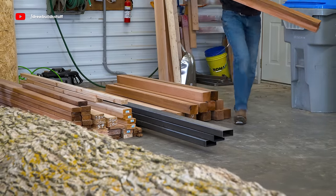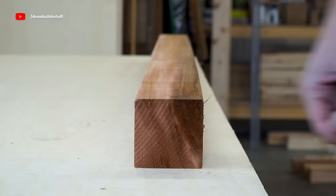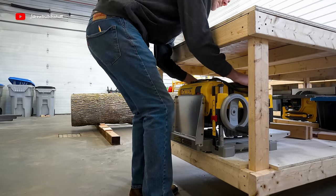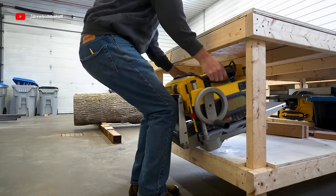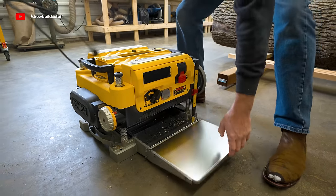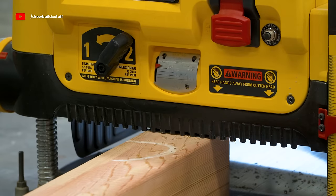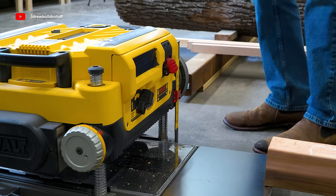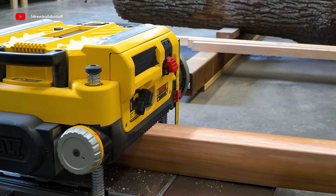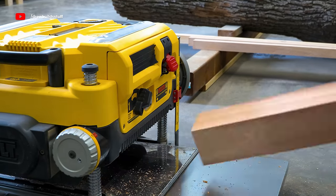Now I'm building a patio set to go with this table. I have some clear cedar four-by-fours, but I'm going to plane them down in width to about three inches so they don't look like standard stock yard four-by-fours. Anybody who builds stuff knows the rough dimension of a four-by-four by eye, so planing it to three inches makes it look a lot more like a custom piece of wood. This is really just personal preference — you could use them as-is, but you know me, I love doing extra work.